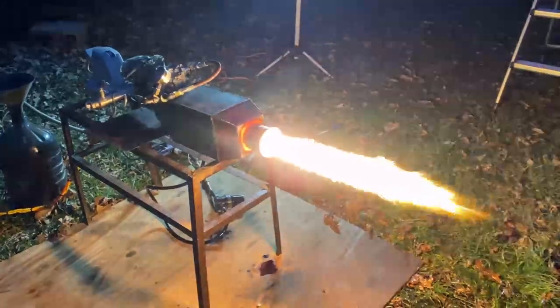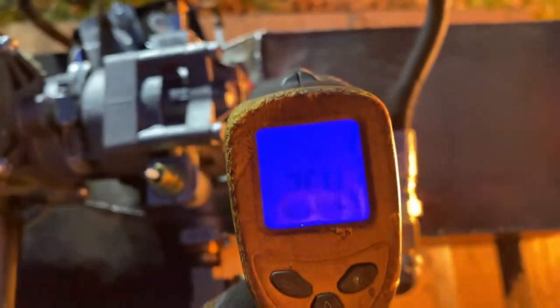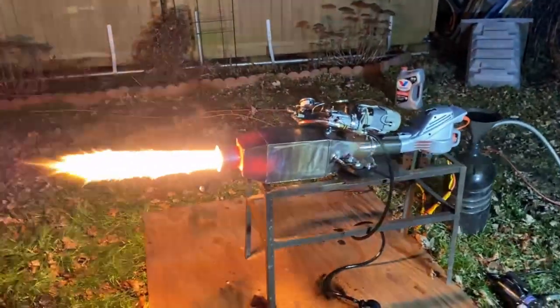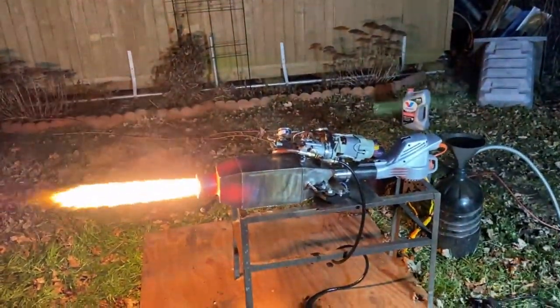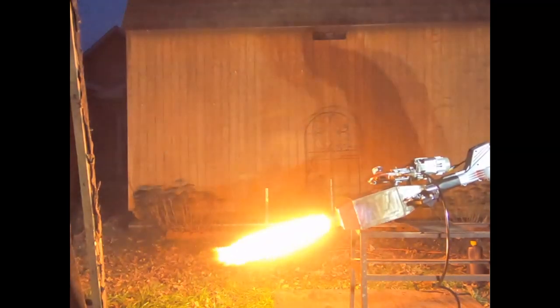I don't want to trouble the customer, so I think we'd be well advised to do some fine-tuning. We're going to go up to a 300-watt preheater, and I think we also might want to insulate some of these lines if we're going to be running this thing in cold weather. My pump is at 200 degrees — that's plenty of preheat right there just from the bypass of that fluid going from discharge to intake. I can tell it can do better, and I'm worried about the oil not atomizing as well as it could. We need the best performance we can get out of waste oil systems because of how dirty they burn.